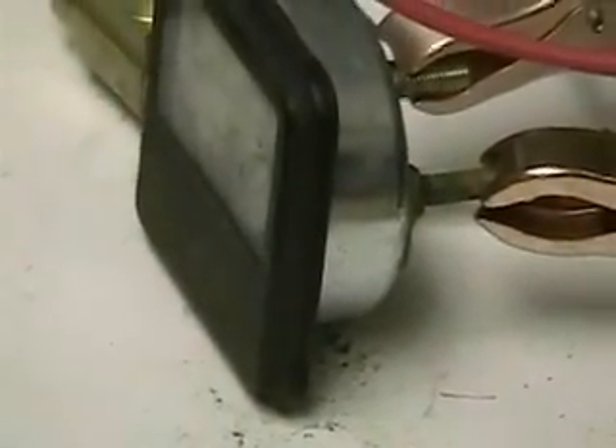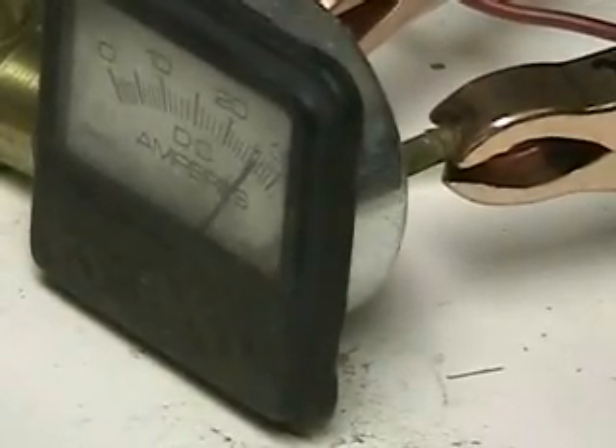What I intend to do is bring this up to 12 plates, which should enable us to leave out the lye. As you can see, we're at not quite 30 amps. If we brought this to 30 amps you would see even more gas coming out.